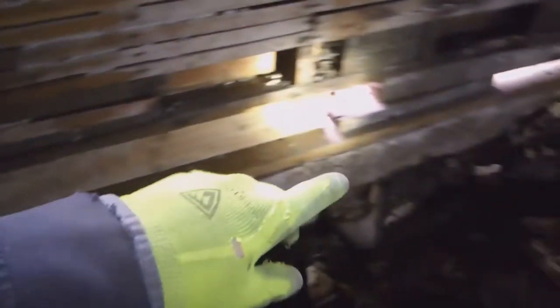Of course, on the outside lip, you can't see it too well, but there's still some siding hanging down. So it created a channel for my rim joist. And all I did was whack on it a bunch of times and get it all tucked into here, and it fit right up to the other one on the other side over in the bathroom. Then I got it all placed in here, and where the subflooring is, I screwed down through to the 2x6 rim joist, and then all along the rim joist here, I used screws to hold it down to the sill plate on the foundation.